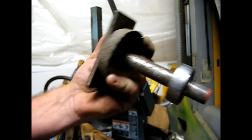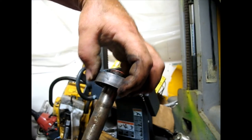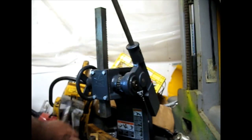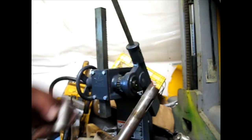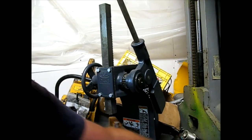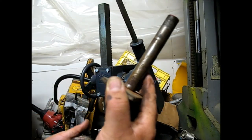It doesn't matter how you get them off, it matters how they go on so you don't damage anything. I just had to finish getting it all the way up — that one was easy, I just kept pulling it up. Another option is a bearing puller or pulley puller, but these ones must be made such that they're able to slip off, which was really lucky. Back to the first one — I'll take the sleeve or spacer off, then wedge something underneath. The second it came loose, it broke free and came up easy.